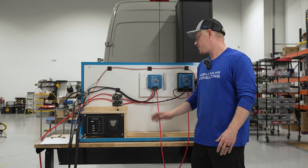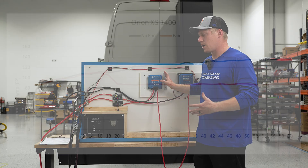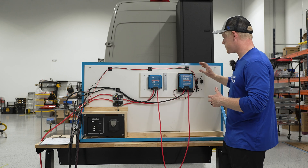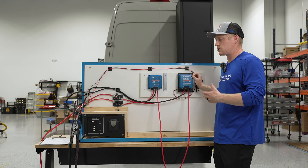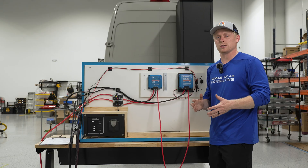We're finishing up our testing on the XS 1400. This unit with the fan is cooling down — I can touch it for a few seconds but I definitely don't want to leave my fingers on it. It's a few degrees cooler than the XS, and that heat sink helps a lot, but we're talking about less than a 10 degree difference in maximum temperature after an hour compared to the XS. It pretty much reached a little over 100 degrees then dropped right down to about 85–86 degrees, just like the other one. So if you want to keep your components cool and operating at the highest efficiency without ever ramping down in power output, I highly suggest putting a fan on them.